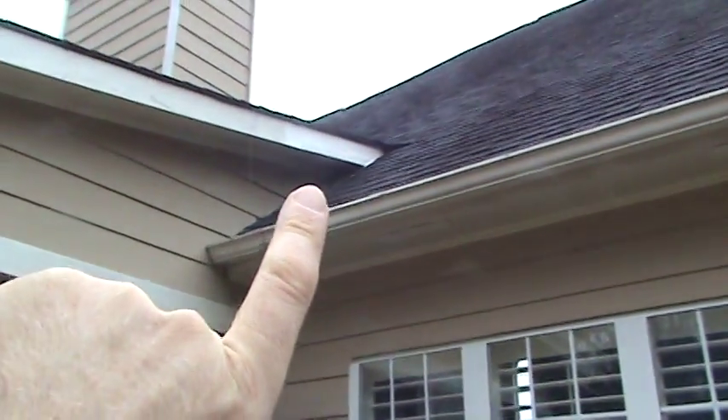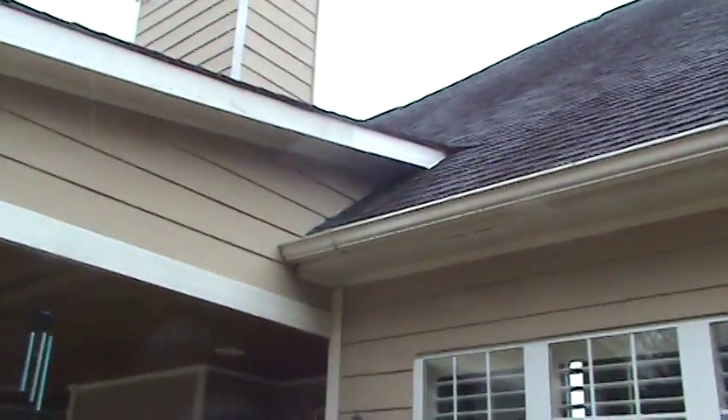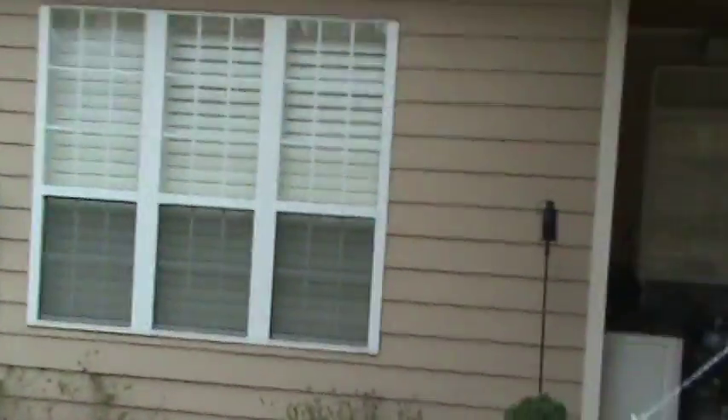On the rear porch we've got some rotted fascia — they just painted over the rotted wood, so we'll repair that piece. These columns right here, the homeowner had someone work on them previously and that was acceptable; we just need to go ahead and caulk those so they won't rot back out again. Cute house — sorry for the yucky weather today.